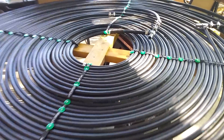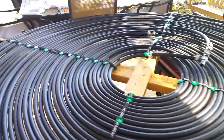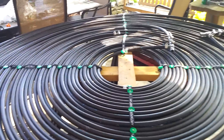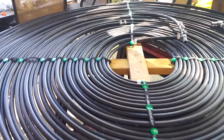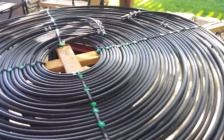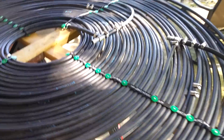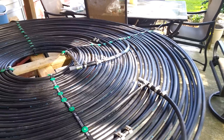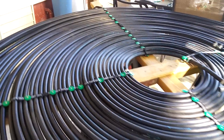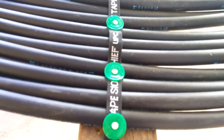I wanted to use rigid on three-quarter-inch, not feed it with garden hoses, because I've tried putting garden hoses up on my roof before. When you turn it off, if you don't put some valves on it and just let the suction suck the water out, you'll smash your garden hoses flat as a pancake. After a couple days of sun on the roof, they'll be totally worthless. So I'm going to feed it with rigid — 500 feet of half-inch and feed it with three-quarter-inch.